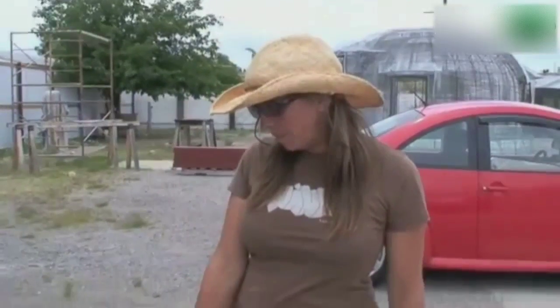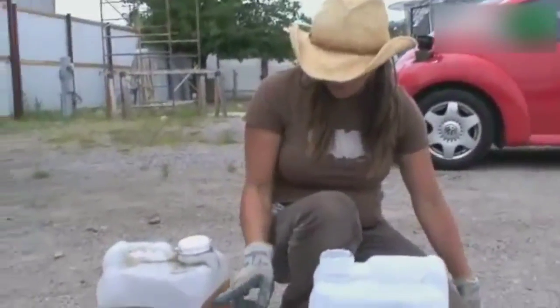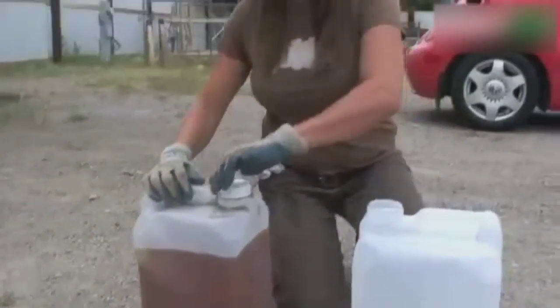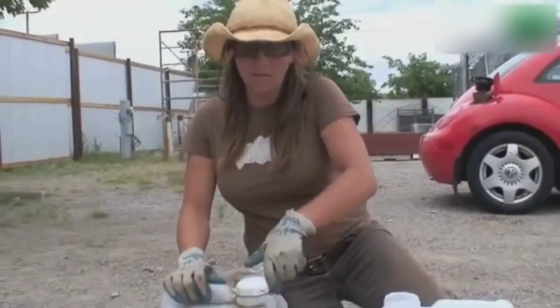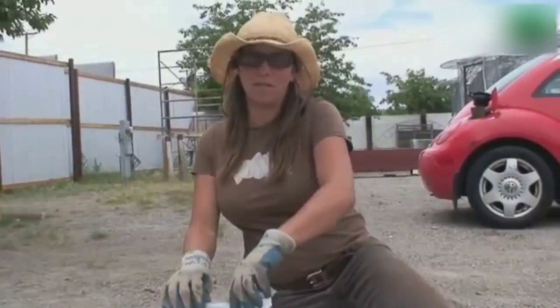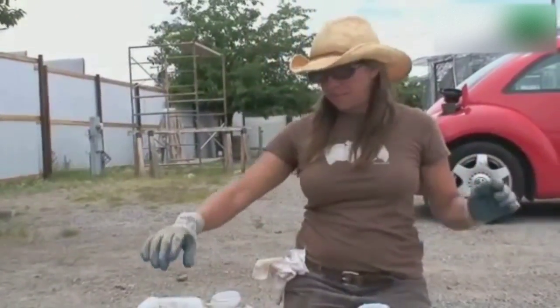It's been three days since we mixed methanol and lye and made methoxide and added it to waste veggie oil — filtered waste veggie oil. And now I'm just going to pour it off. What happened, you can see, is it's quite light and then at the bottom there's some darkness. The darkness is glycerin and that's the byproduct. So the chemical process took all the heaviness, gelatinousness out of the liquid and left this glycerin, which we're thinking about making logs out of.